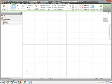I'm going to begin with a circle, and when I measured the finger that I want the ring on, that's the diameter that I'm going to type in. So from my circle, I'm going to start from my origin, wait for a green dot. And this diameter here is going to be the diameter that the circle template told you your finger was. On the circle templates, it's in fractions of an inch, so I can also type in a fraction. Mine was 7/8 of an inch. Or if you know the decimal equivalent, 0.875.